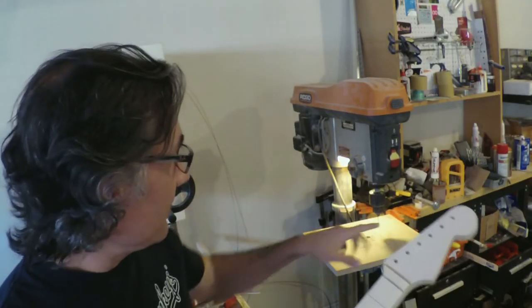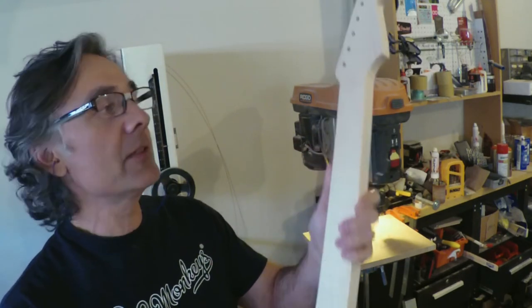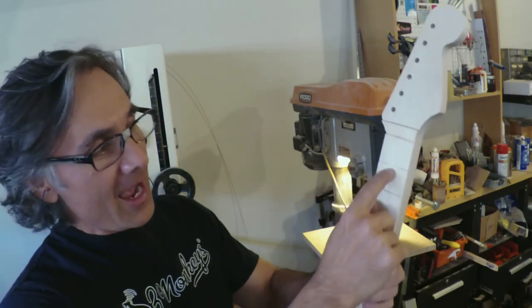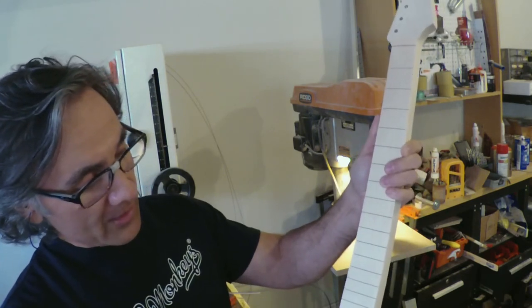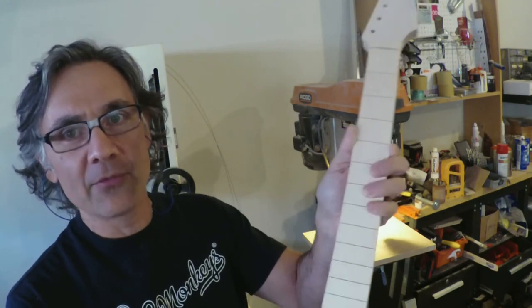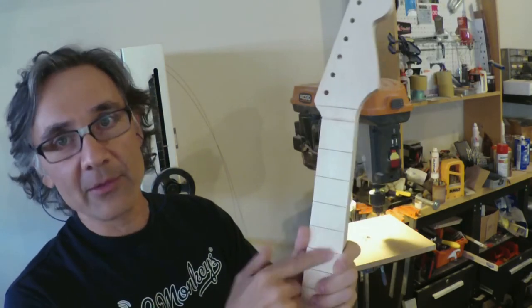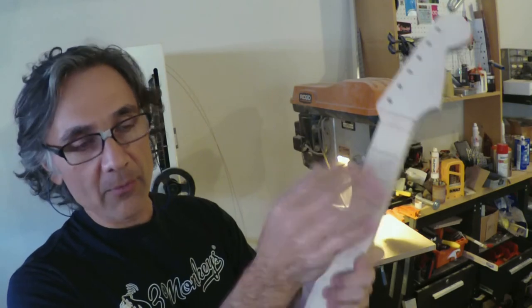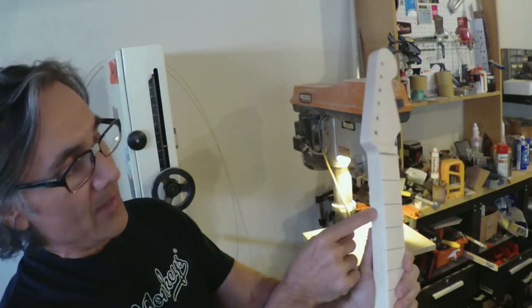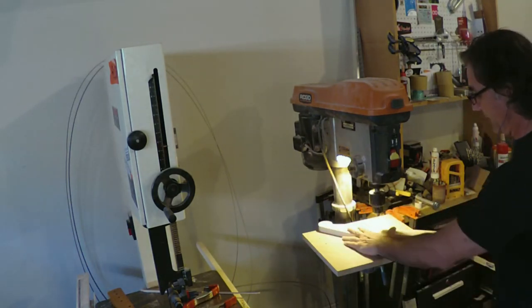Okay, so we're back at the drill press and we've got our 16th inch bit chucked in. And what we're gonna do is drill three holes in a triangular pattern right through the fret slots so that when you fret them, you're not gonna see the holes and they're not gonna interfere with anything. We're gonna do one at the first and probably two more at like the 15th, 17th fret. And this will really allow us to relocate the fretboard back onto the shaft anytime we want. And then be able to work on the neck without the fingerboard on it, and then replace the fingerboard in the exact right position when we glue it on. So I'm going to go ahead and drill these holes right now. They'll probably go maybe an eighth or so into the shaft wood itself. So let's go ahead and do that.